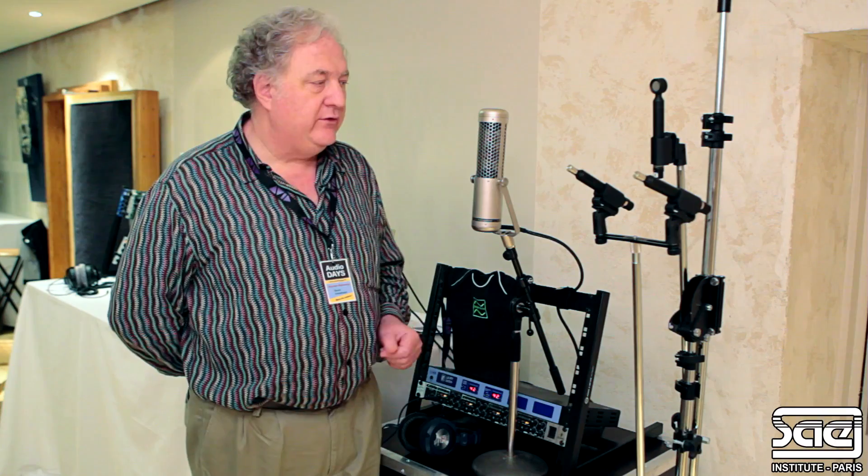The most powerful version of that technique is the C700S, which is the same as this microphone with an additional capsule — a third capsule that faces sideways. If you're familiar with MS recording, you can recognize that you generate the M signal from the omni and figure-eight capsules in the front. Typically, half of omni and half of figure-eight gives you a cardioid. And then the S signal is generated from the side-facing capsule, so any kind of stereo or surround recording can be made with these three signals.